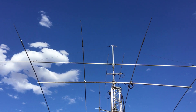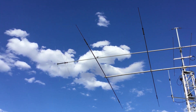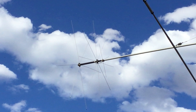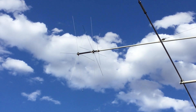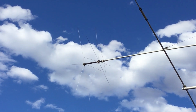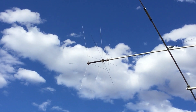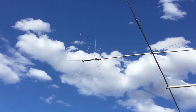So it gives you half wave on 20 metres. And then you have the capacitive hats and windings — I'll try and zoom in on that for you — which will give you 40 and 80. You can trim it for any part of the band that you want. So even if you want to do a 75 metre band you can tune it for that, but it's very narrow on 80 metres. So it can be tuned for any frequency you wish.